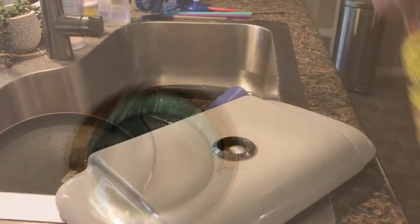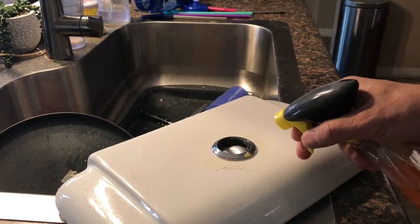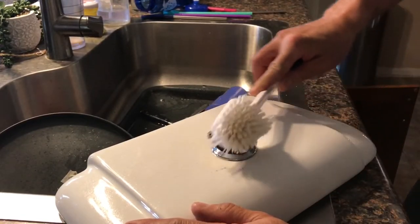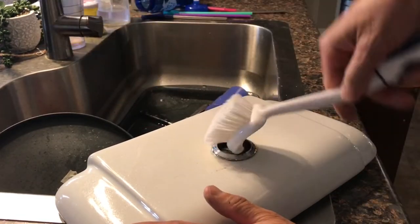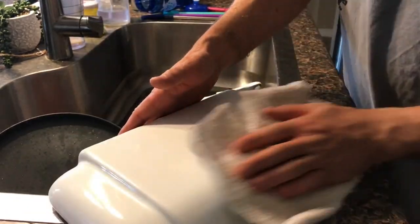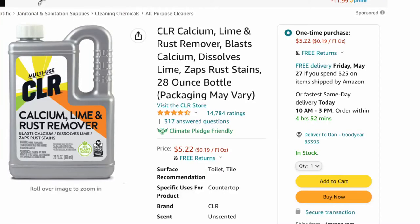If you chose to shut the water off, go ahead and push that back in so you can supply water to verify your repair. Before putting the lid back on the tank, I took some Goo Gone and cleaned out the push buttons. There was a layer of lime on the push buttons because of the hard water evaporating and creating a mineral deposit. The Goo Gone did work okay, however a product like CLR probably would have been the way to go — I just didn't have any at the time.